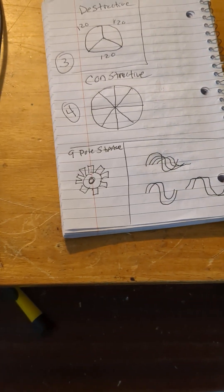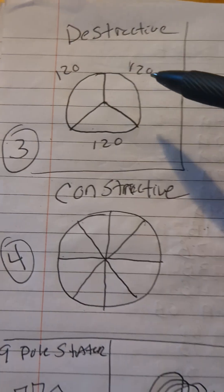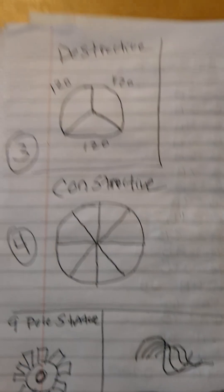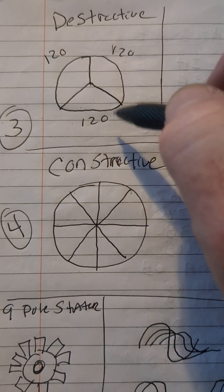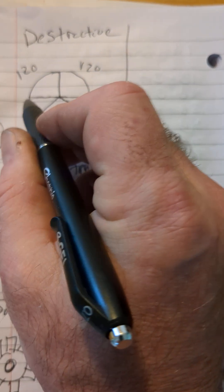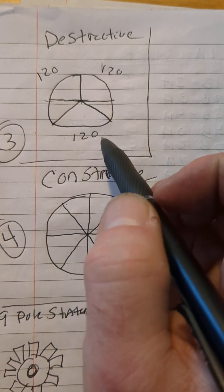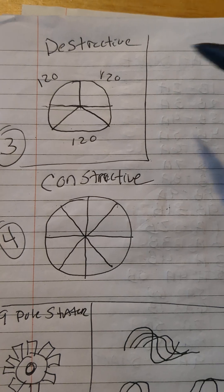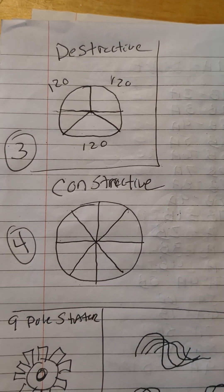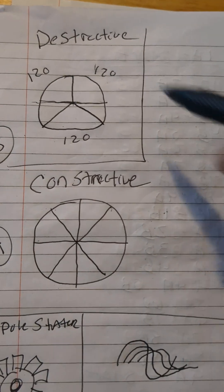But there's a lot to this. Why use nine poles? Why not use three phase? Because three phase is destructive. You have your three phases 120 degrees apart. When one phase is at peak, the other two are in the opposite polarity. So you cannot series all three together — it becomes destructive. You have to rectify it to fix it. That's not what you want.